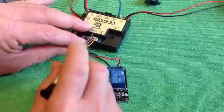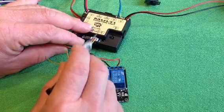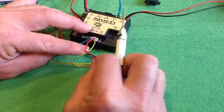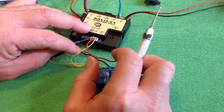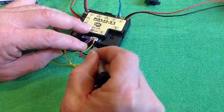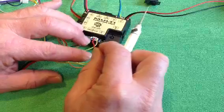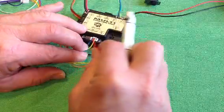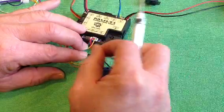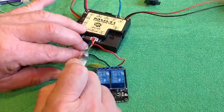The next two are the ground triggers. They're turned on by a connection to the ground inside the MFU here. The first one along the track is actually the machine gun. We'll look at the second one - the headlight - because that's the easiest one to do. The headlight ground - it's black here, that's just the way it is - the headlight ground is this pin. It's the second wire in.